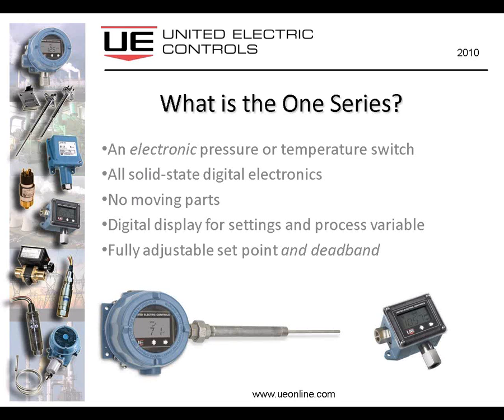And finally, and I probably should have put this bullet first, but we have a fully adjustable set point and deadband. And again, unlike a mechanical switch, which has a somewhat adjustable set point and typically a fixed deadband, with the 1 series it's programmable. So you set both of those wherever you want over the range of the sensor. And if you think about that just for a second, you realize how many applications that opens up for a device like this where a mechanical switch just would not be suitable.